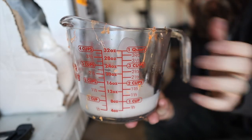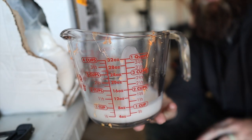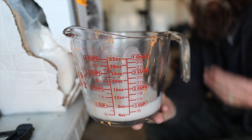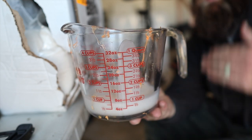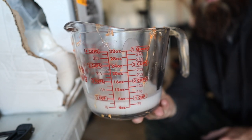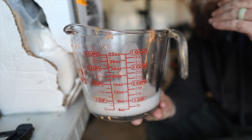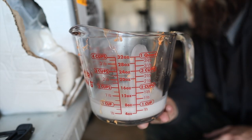This is plastisol in its raw form — it has this milky look to it. What we actually have to do is heat it up in the microwave to get it to form into that clear plastisol that we can add our color to, and then it will be injected into our mold. So we're going to move over to the microwave and start incrementally warming this stuff up. While we do that, I want to talk about some of the additives and colors we're going to be using today.